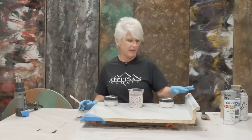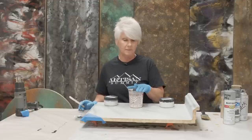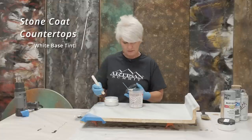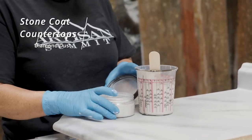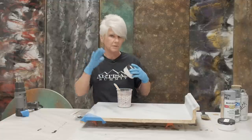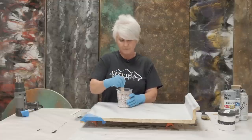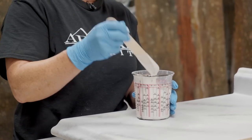We're back and I've let my fogged paint dry. Meanwhile, I've mixed up 10 ounces of the Stone Coat Countertop epoxy. I tinted it with the white Stone Coat Countertop base and I'm going to do kind of a wow factor. I'm adding a little bit of the diamond dust, and when I say a little bit, I really mean a little bit. I don't want that to be the focus of the finish — I just want it to kind of catch your eye as you walk past and if there's a sun coming through the kitchen window, that's going to catch your eye. I've done my white base pretty opaque, so I'm not really seeing through to the substrate.